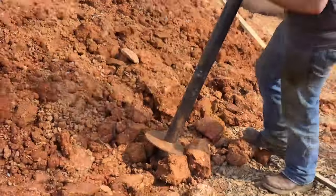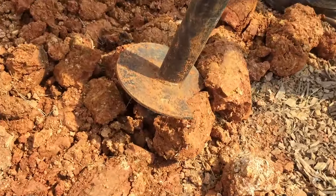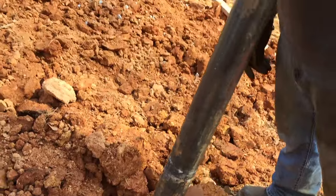But that has led to a soft spot under a foundation that we need to take care of before we put a house on top of it. So the helical piles are going to go down deep. They'll support the foundation in the soft area with friction.